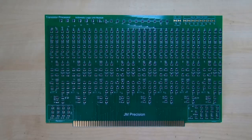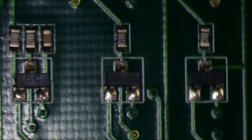This is the finished board — it's been through the reflow oven. I skipped past that part to avoid repeating a previous video. As you can see, it's reflowed nicely. All the components are in their correct locations, accurately placed. The solder paste has done its job pulling them all exactly square. I'll test the board to make sure it works, but I've looked at it under the microscope and it looks fine.